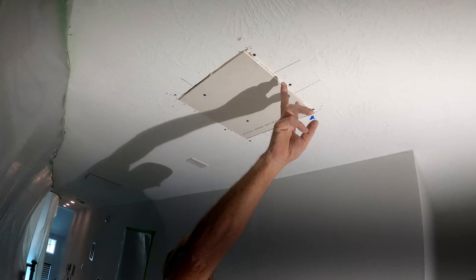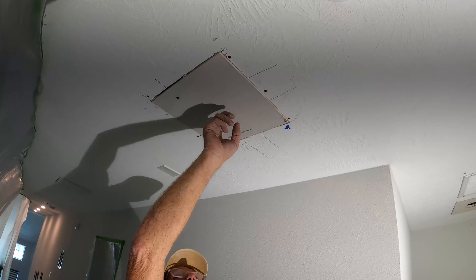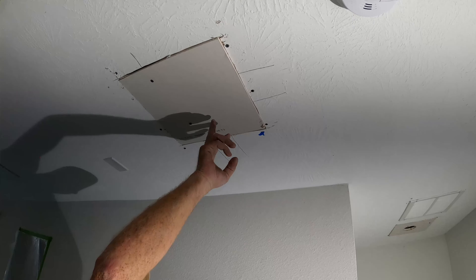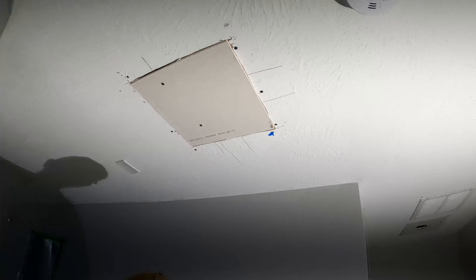Here's another example — I just got my two lines on one side, two lines on this side, and that gives me my center. As long as I get in that center on that cut, I'm good. Go in, then touch, then you pull out, come around and follow your circle. Always want to do counterclockwise.